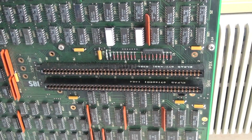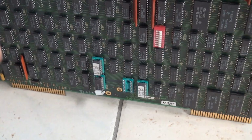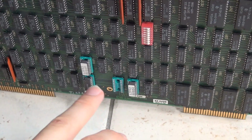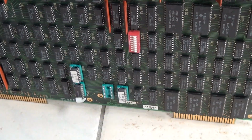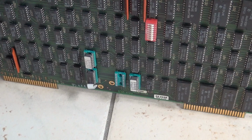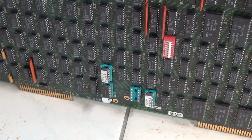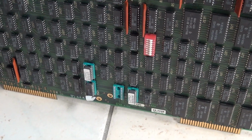These are 4-bit ROMs, and it's a 16-bit machine, so they do some tricks: one word is read in 4 cycles, and this is a bit tricky. We see 4 slots here, but they're not read in parallel. One ROM contains one firmware, and if you look at 4 consecutive addresses, you see one instruction. I have some of the firmware already downloaded from the internet, as other people also did ROM dumps, and I compared it. So I can confirm that my readout works.